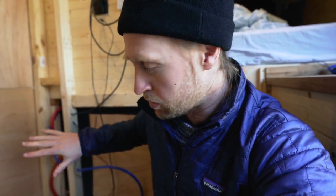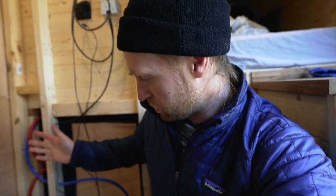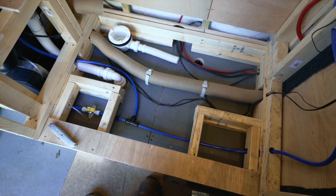I've come to a little bit of a standstill though, because I need to drill the hole in the shower tray for the ventilation pipe for the toilet, but I can't do that until I've got the ply on the wall and the shower paneling, because I'm not going to know exactly where the toilet's going to sit until that's on. I've got the ply, which I can screw on, and I've got a sample of the paneling coming in the post. I'm hoping it's going to arrive today. I don't know how big it is, but I'm hoping that it's enough to put on the wall and tell me where I need to drill the hole for the toilet, because I can only do that the once, so I want to make sure that that hole in the shower tray is in the exact position it needs to be. But this is where we're at with the shower tray at the moment.